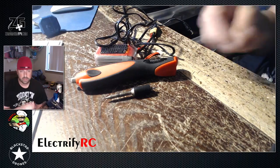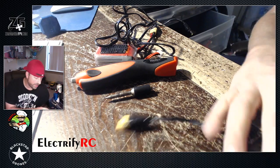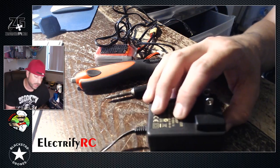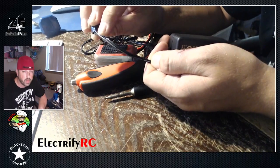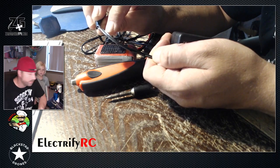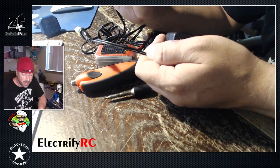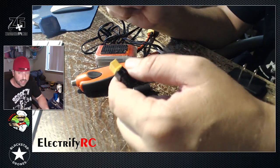Those three things — this wire and a small bundle of solder — and I could really get away with just that. On US plugs: yes, they are essentially all the same, however never ever trust the markings on any plugs. Always test with a voltmeter. On most US plugs you will see a broken white line on one wire — that will be your negative. The positive will be the other one. Always check the polarity.